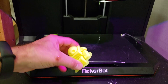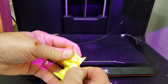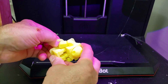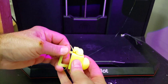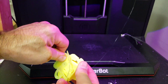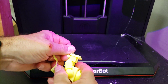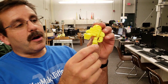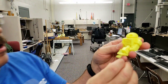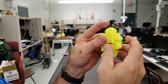Let's see how easy it is to remove with the brim. It peels off — there's much less plastic, and these just tear away instead of all of that raft that was attached before. That's why I'm so fond of the brim right now: there's less plastic wasted and it peels off much easier. When all is said and done and you've loosened up the little joints, brim is a pretty darn nifty way to print your items — frugal and fast.